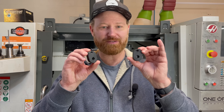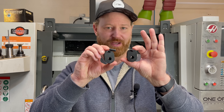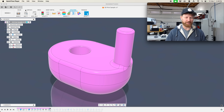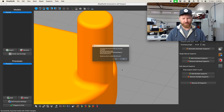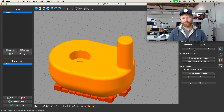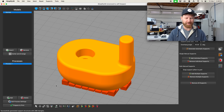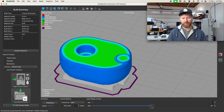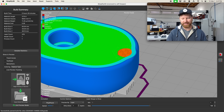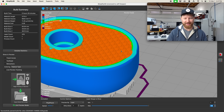If you can't find any differences on the outside, then certainly you can find differences on the inside. Here's the original part. Let's take this to our slicer and see exactly why it broke. As it drops in, I'm going to generate automatic supports — notice we have some supports on the bottom — and then run the prepare print. Let's go down to the exact place it broke. Notice here it is building this wall or boss on top of infill, so that's not a lot of material to be laying material down onto. It's not touching a lot of material, and there's not going to be a lot of bonding there.